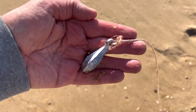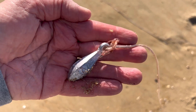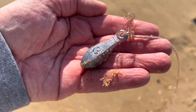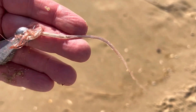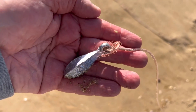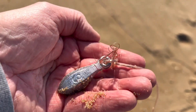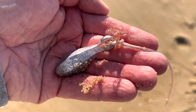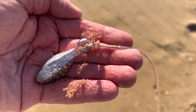One of the things I do to keep these wires stationary — because the surf will kick them everywhere — is I use fishing weights, basically nice 3-ounce fishing weights. And I use 16-gauge speaker wire for my counterpoise wires. At the end I tie it off on the weight, and I expose about an inch and a half of the copper wire so it can conduct into the salt water.